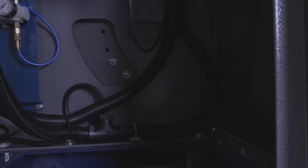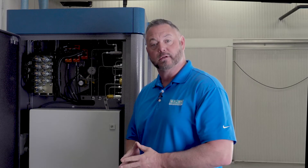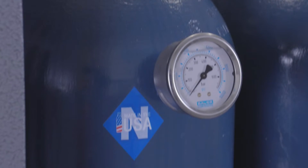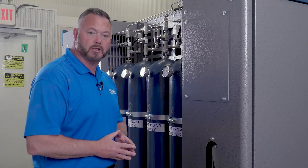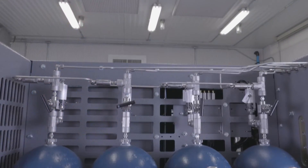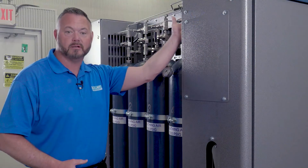As we look at the bottom of the insulated compartment, we see the option for a high pressure hose reel. This option comes standard with 100 feet of high pressure hose and is controlled through our HMI touchscreen control system. This option is also available in a panel mounted remote fill as well. Located on the back of the Unicus 4i is the storage receiver compartment with two standard 6,000 PSI ASME cylinders. However, the compartment comes factory installed to accept four storage receivers in total, so if you want to add more ASME receivers in the future, all you need to do is tie them into the existing plumbing.